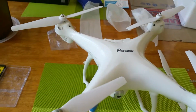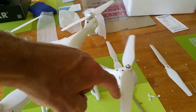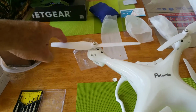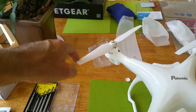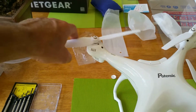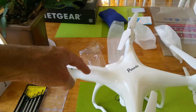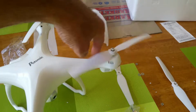Also, on the back side, if one notices, first of all, how easily the other propellers spin, nice and smooth. And if we go to this one here, we watch it smooth, and get to a point where it no longer spins smooth. You can see there it is right there. And sometimes it's catching so much that you can actually move the drone around before the propeller spins. Clearly the other props are not doing that.